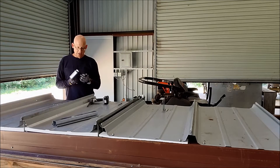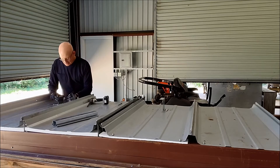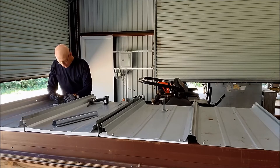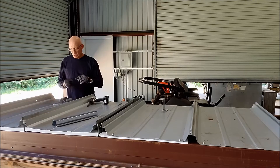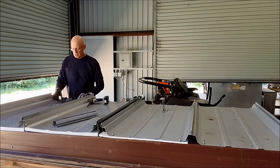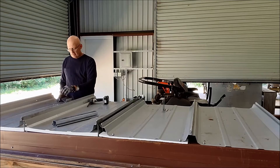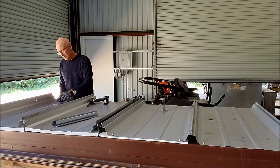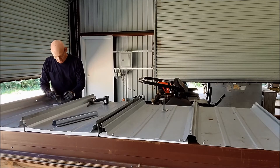With the high-floating setup, the best way I've found is to take a Marks-A-Lot, set your Z where you want it, and then mark your holes. Once you get your holes marked, take a drill with a three-eighths-inch bit and drill through those two holes. Once your holes are set, take the sleeves and drop them into the holes and set them on top of the purlin. Your sleeves go in, and then your hat support Z goes on top.